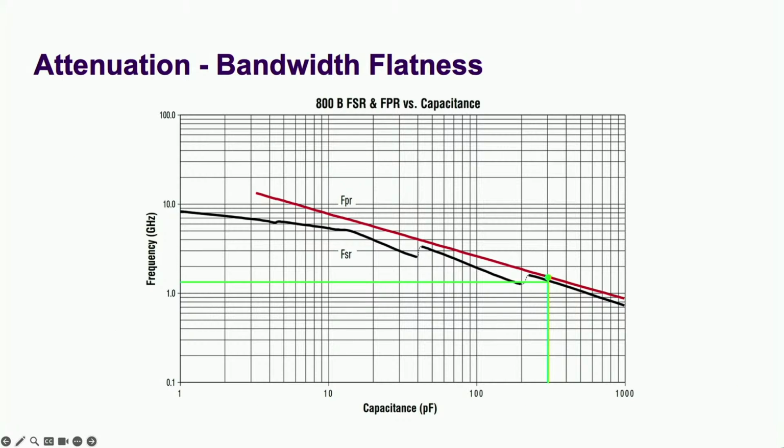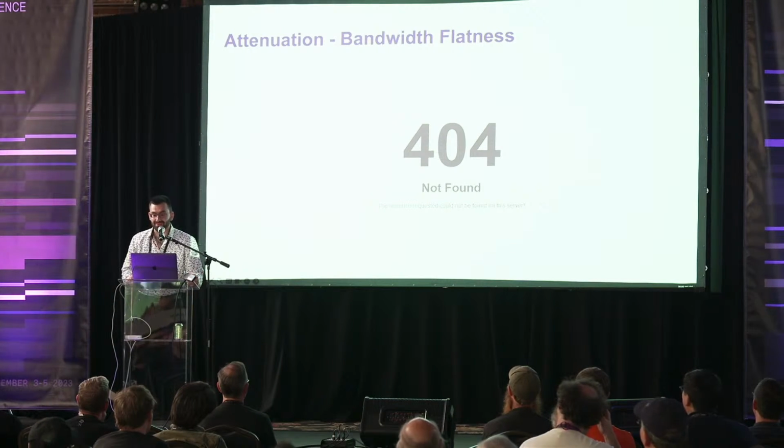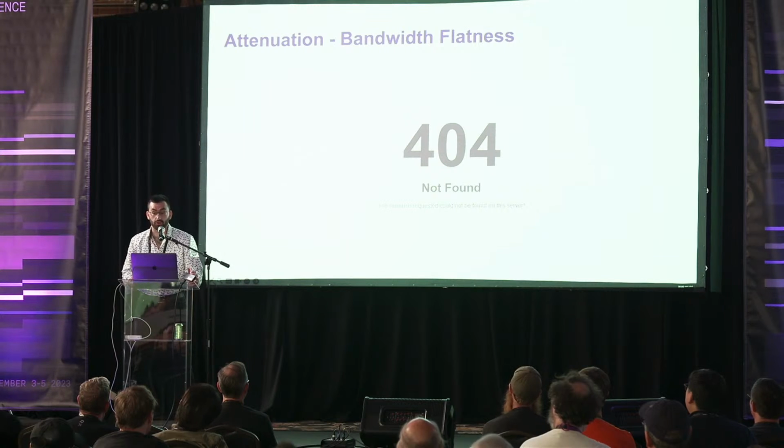After scouring the dregs of the internet, I found a few families of really fancy RF caps that go past 100 picofarad in value and have a SRF of 1 gigahertz or higher at 300 picofarads. This was the best of them, the ATC 800B series. I haven't tried them yet, but hopefully having something that is capacitive through the whole frequency range will make the attenuator behave a lot better with probes.